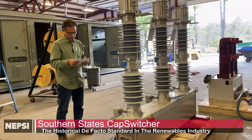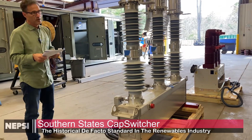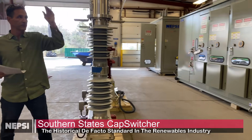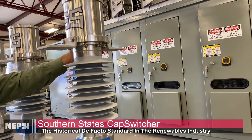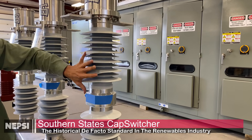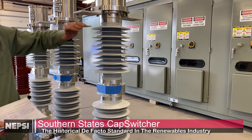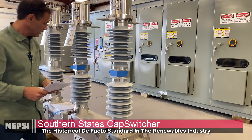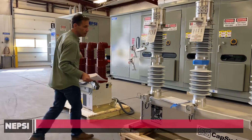The Southern States cap switcher is 200 kV BIL with a weight of 475 pounds. We take this switch and insert it into our equipment. The bus connections are on top — it comes with connections on both sides, but we take one off and drop it down below. The resistor, the SF6 gas, and the interruption take place between the ingoing and outgoing terminals. So without further ado, we'll talk about this new alternate technology switch.